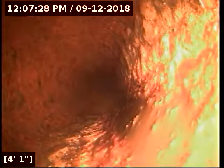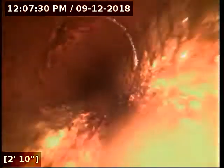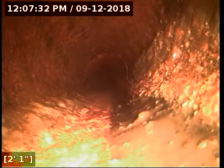All right, cast iron transition is underneath the carport that's closest to the roadway. We're at 1 foot 3 inches deep there. And by the time you get out near the end of the line, you're right around 7 feet deep. We're going to go ahead and reel the camera on out of the line here. Again, recommend a full update to all the concrete pipe we just scoped there from 8 feet to 86 feet.